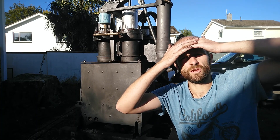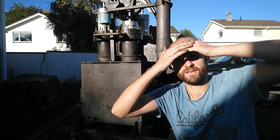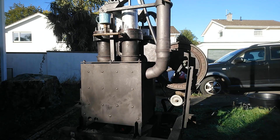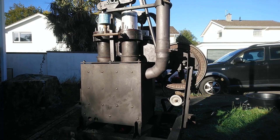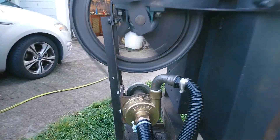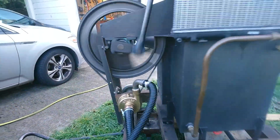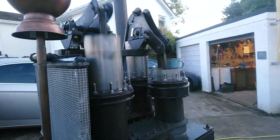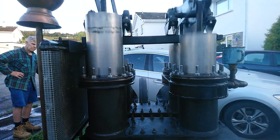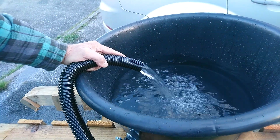I'm going to run it for a little bit, let the leather seals bed in, and let the pump wear itself in a little — I don't think it's been used for quite a while. I've just pumped some grease into it and then we'll turn the water on and see what it actually pumps. The engine is going at a fair lick at the moment, the pump is merrily spinning away. There's a bit of a leak here but I'm sure we can solve that. The leather seals are doing okay. I'll just show you how much water is flowing — it's a casual flow of water.